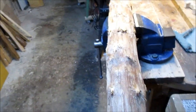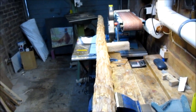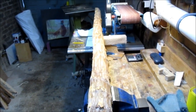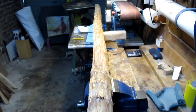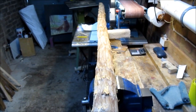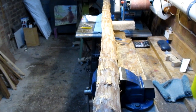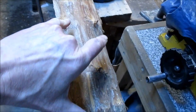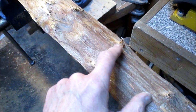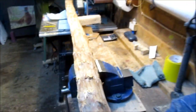The other thing is, he actually had two staves he offered me to play with to make him a bow — I think he wants 110 lb, I'll have to check. The other one was one of these Italian yew staves that some bloke had sold him for a good amount of money. Well, it was fairly hideous — the same length overall, with about a 45-degree twist in it, and a patch about a foot from one end where the sapwood was totally missing. And you think: do you saw that off, or do you patch it? Both options were above his pay grade — he's just starting out making bows.